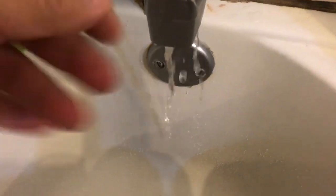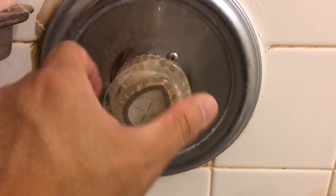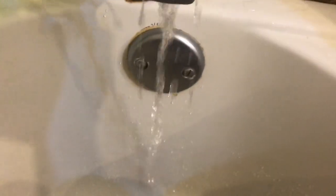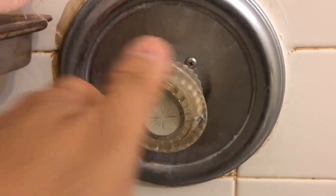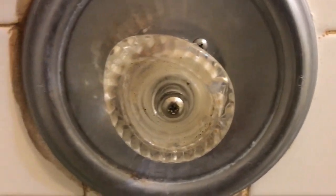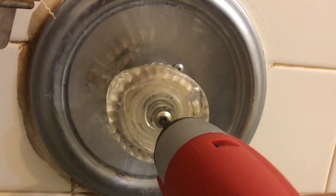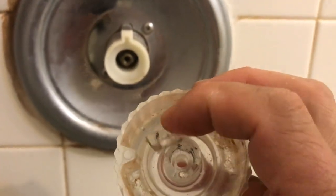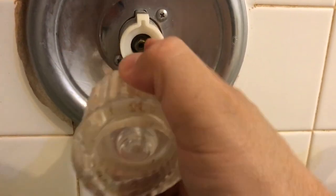So what's wrong with this shower — even if you turn the knob, the water keeps flowing. We're gonna find out what's wrong with it. First we're gonna remove the top, and then there's the screw. So this one — see there's a broken piece here — that's why it's not engaging the knob inside.